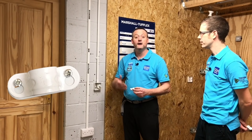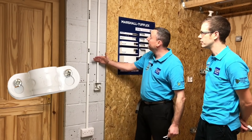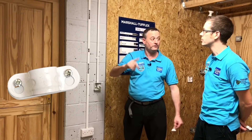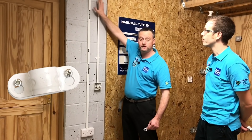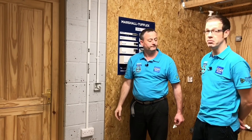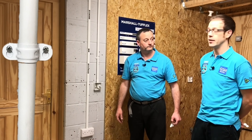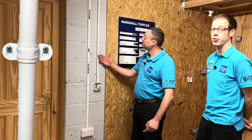We saw them in electrical wholesalers, and when we raised it with some of our Level 3 work-based learners, they said yes, but they're difficult to get hold of. Hopefully as we progress deeper into the 18th edition that will improve. These are glossy white metal saddles — not plastic — securing the conduit in place. In the event of a fire, the PVC conduit is going to melt and disappear because it's not fire rated. However, the cables inside will be retained and held in place by those metallic clips, which are naturally fire resistant.